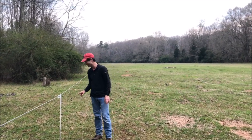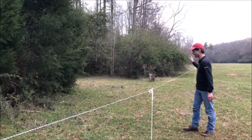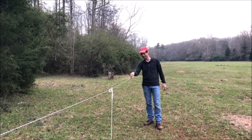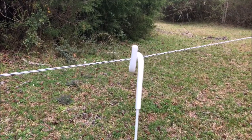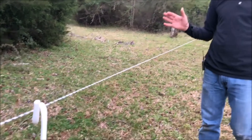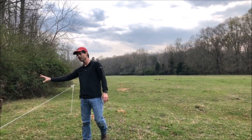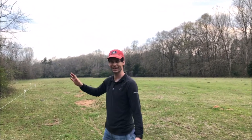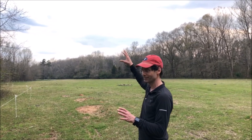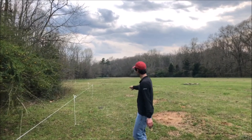These pigtails are a good way — they have a rubber or plastic thing around them here so they're not conductive for electricity. The wire can go through there, and it's a two-prong attachment in the ground. It's really surprisingly sturdy. It can get pushed and pulled and it's fine, so if a deer comes along and hits it, it's not going to just snap the wire. It has that give, which we thought was important. When we get around here, we were trying to go far enough away so that we can mow on this side if we need to, or the cows can graze on that side. Because when we get to the end, we were short on rope, so we had to kind of make a turn. There's a big open pasture that's not cut off the way we wanted, and this gives a path for them to get to it.